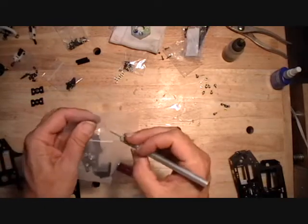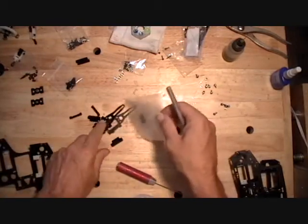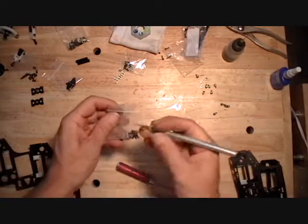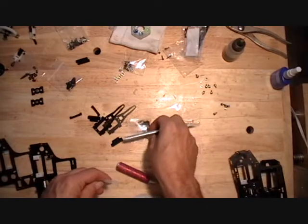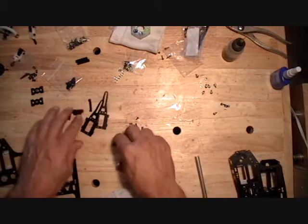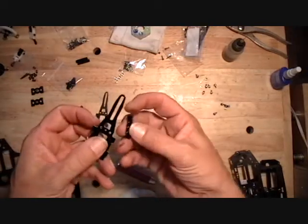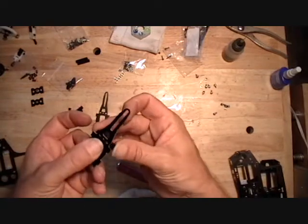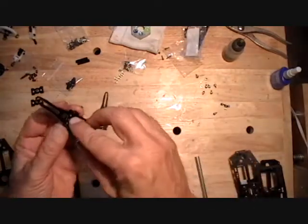In this same pack we have the anti-rotation plates. They have two frame spacers. This frame spacer has a little radius in one of the slots so it only goes on one way. If you try to put it on the other way it won't set all the way down. Find that little radius.